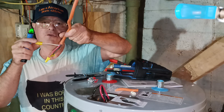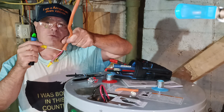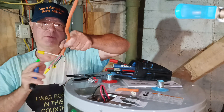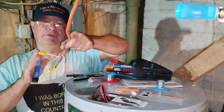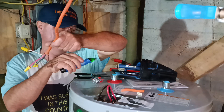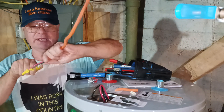There are instances where a white wire can be live, and they'll be in a 240 volt circuit where the appliance does not require a neutral. We're not going to be using this neutral here — we have a red and black — but we're going to leave it capped off inside in case a new style of water heater gets put in that does require a neutral.